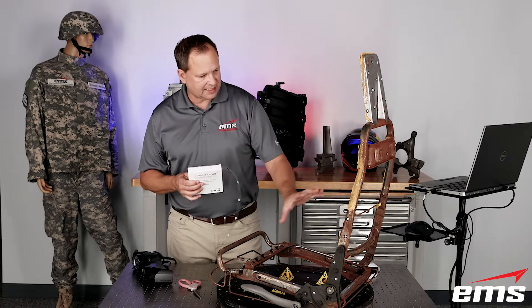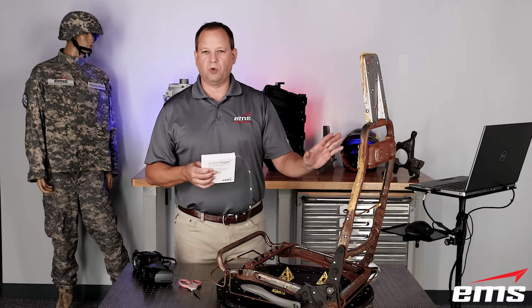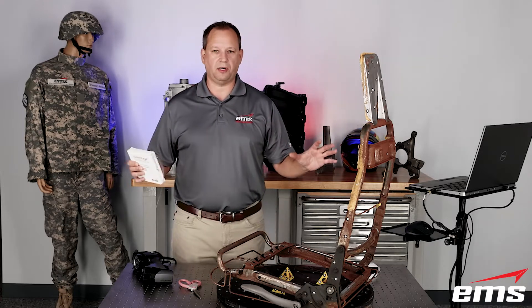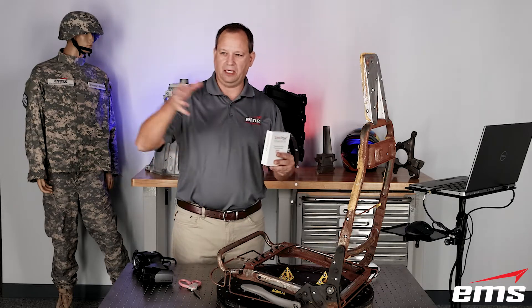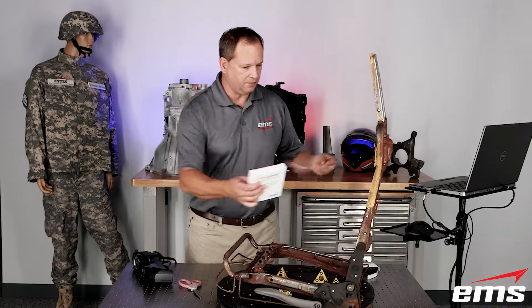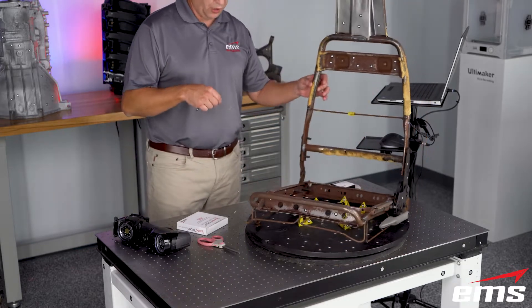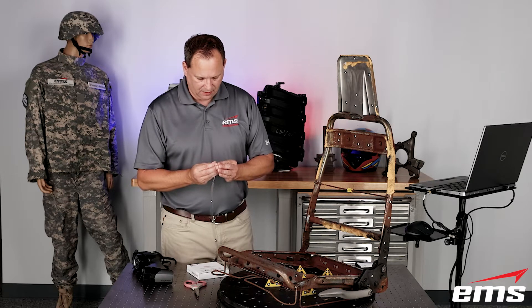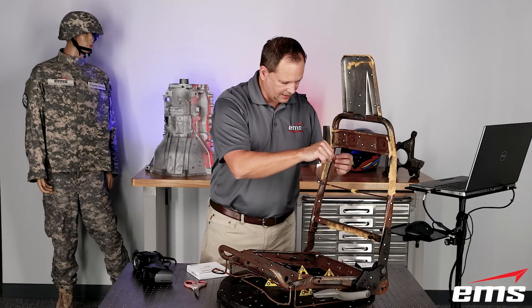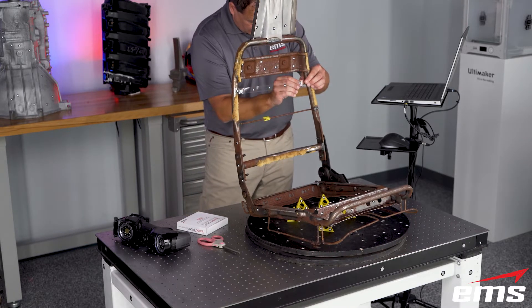How I'm going to use it on this part is I'm going to basically stretch it across some of these open voids. Otherwise, if I try to scan this whole area, it's really going to struggle. I could put targets on the round areas, which I've avoided, but we'd have accuracy issues — I've already tried it. Think of a race car tube chassis or a big piece of automation equipment — you've got these big gaps that you need to move across while keeping everything in relationship, and it's just hard to do. So what you do — I'm going to peel this out and go a little bit longer to show you. This is a very durable mylar-type material, very strong. I'll peel off the backing and put it in some key spots, wrapping it around and kind of taping it to itself.